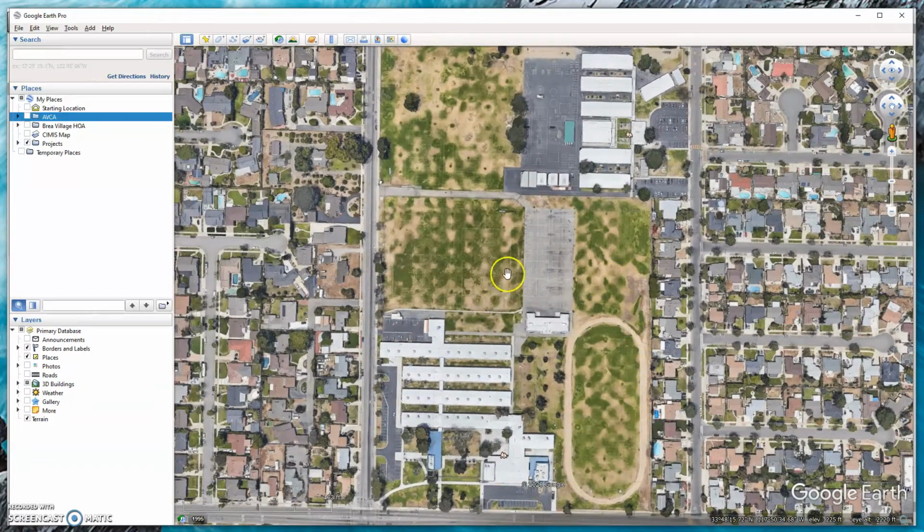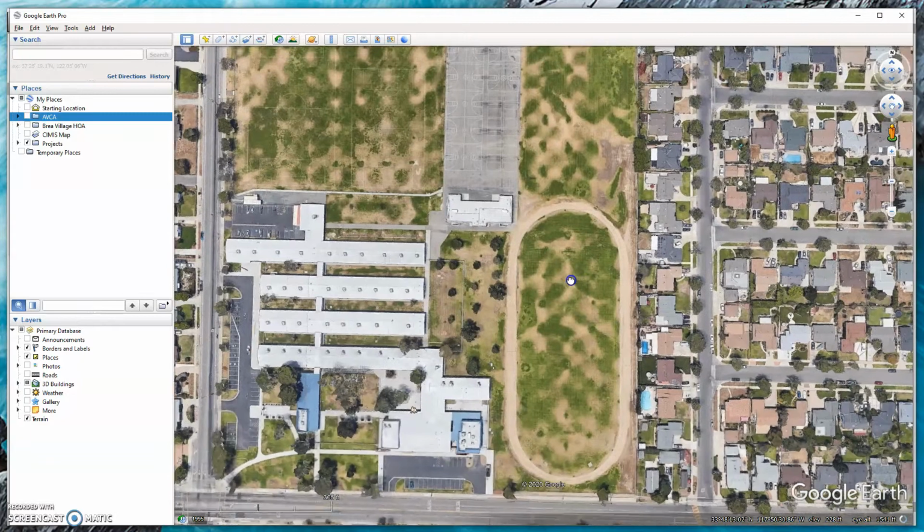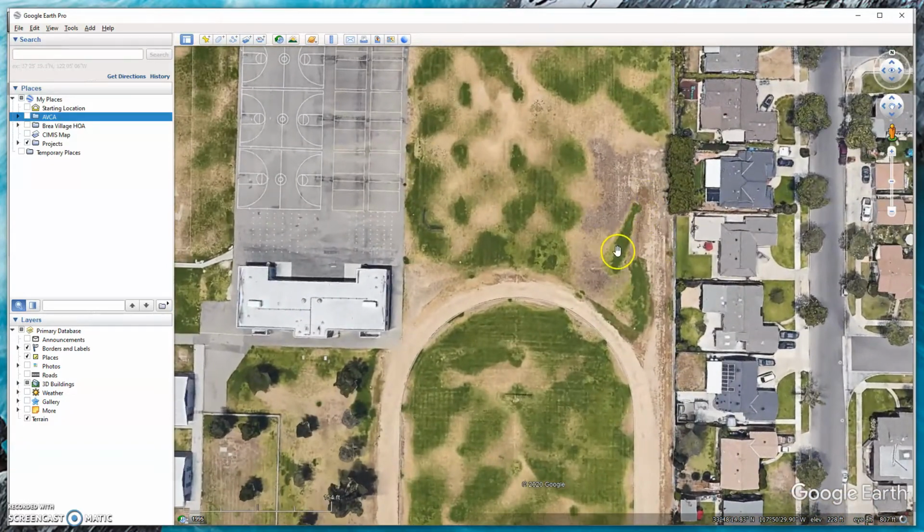So you can see, just due to head spacing and such, some of these might even be rotors that aren't working anymore. Here's a telltale sign, like this rotor is broken. The rotor has stopped rotating, so the rotor's here and then the spray pattern's here, but since it's no longer rotating, it's just stuck. And it's not irrigating anything else around it. And so it just is permanently stuck in this position.